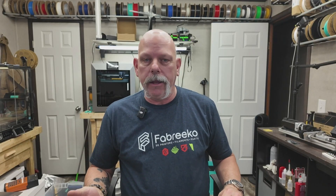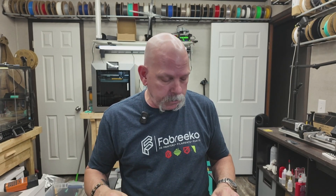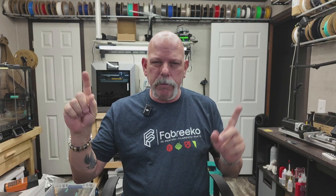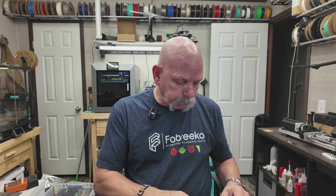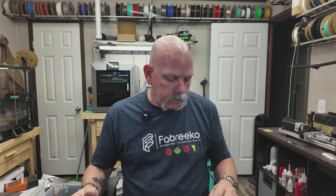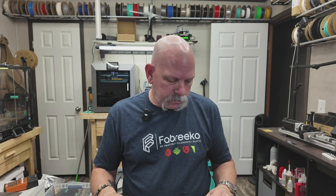Update on PLA — our favorite filament. Well, my favorite filament. It's cheap, it's easy to print. And as you've seen in my high temp PLA launch video, I printed everything on an ANET A8 — printed just fine. I ran the high temp PLA through all of the normal tests using the advised temperature print settings that Polymaker supplied me with, and layer adhesion was not great. In fact, it was bad. Still usable, but not what I would like to see.